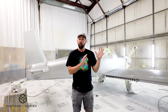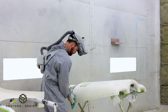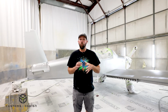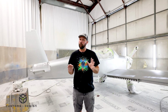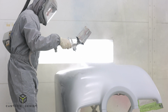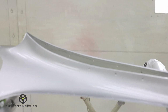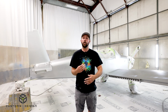From raw aluminum, we cleaned it with an aluminum cleaner and brightener called Metaflex. It's a water-based product, and it's just a wipe it on, wipe it off kind of thing. Once the Metaflex has been wiped on, we use a special non-chromated etch primer called 2111. Chemically it gets along with the aluminum, and that's what creates your etch bond. Once that 2111 has set on the surface for about an hour and a half to 2 hours, depending on temperature and humidity, we can go into our paint product.